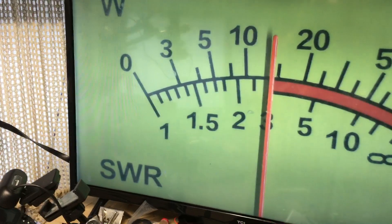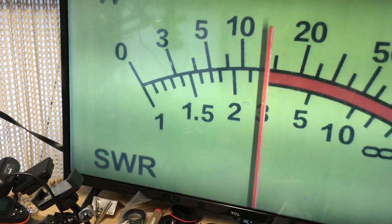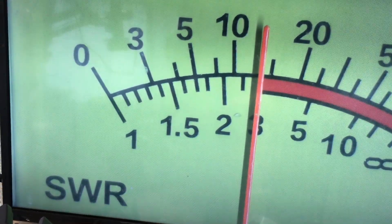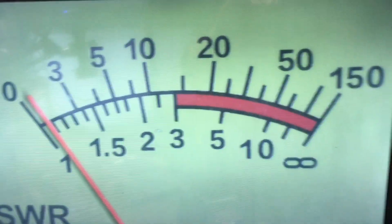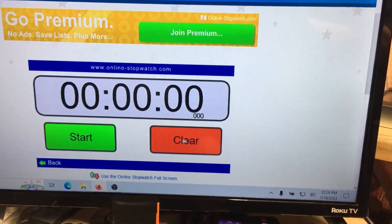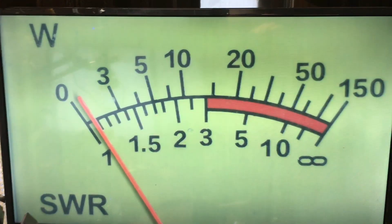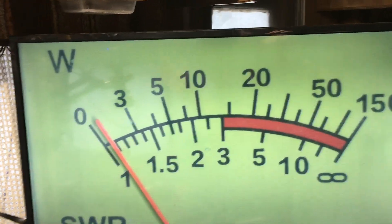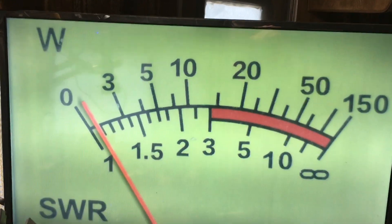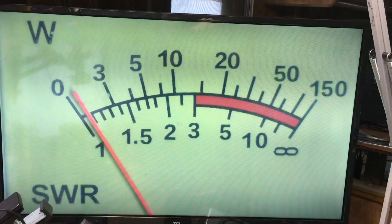Let's check the temperature on the dummy load — we're at about 100 degrees, so that dummy load is getting really nice and warm. Let's stop the timer. We're going to do it again and I'll show you one more time. When it keys up I'll start the online timer. Within about a minute it looks like wattage starts dropping. So if you're trying to do this, you may be losing wattage using the stock duplexer. Very interesting — that's the answer to what happens.